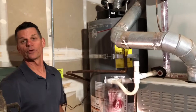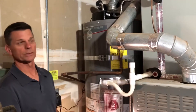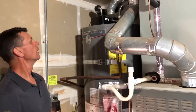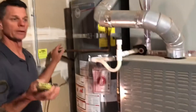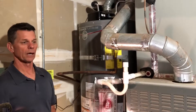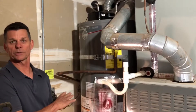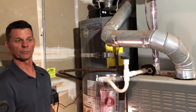There are also requirements for the vent termination — it's required to be at least 12 inches above the roof deck. That's about it for this inspection. You can view this video on our website at BuildingCodeEd.com. We also have a guide that walks you through the inspection and we'll provide some other free content on the website.